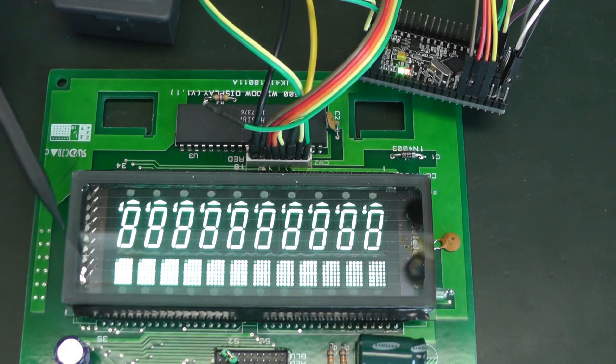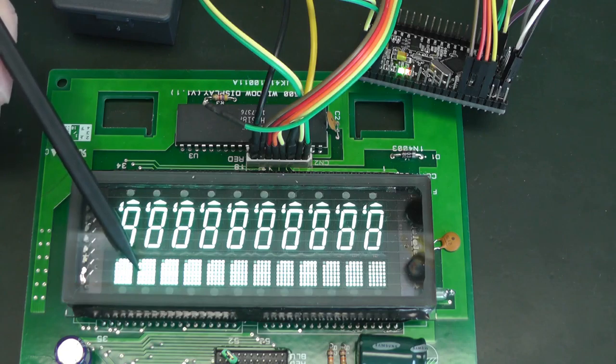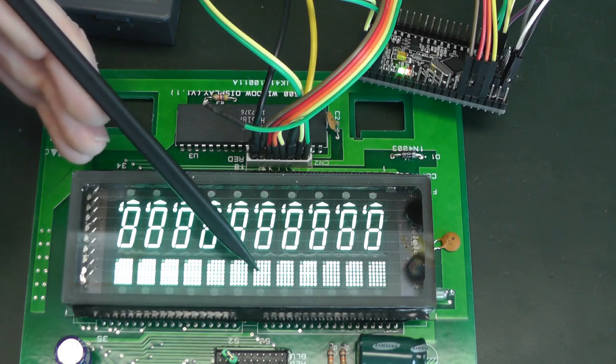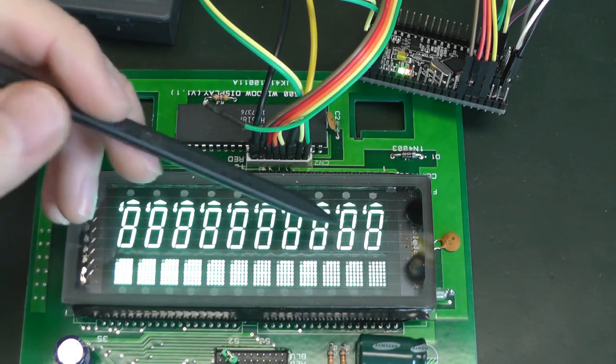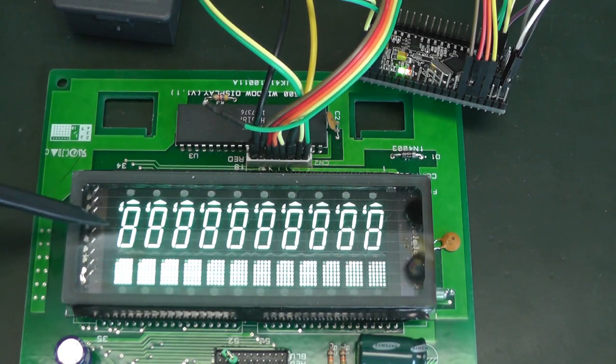And the idea of multiplexing is that you first select which part you want to light up, and then you control which segment within this part you want to light up. For example, we know how to enable or disable all the grids. I will call them the grids, because if we look closely, this is actually what you see, which is separated. So the grid which enables the electron to fly through or not is what you control. And all these parts are controlled by one grid.